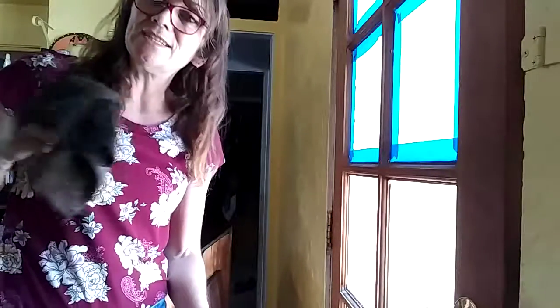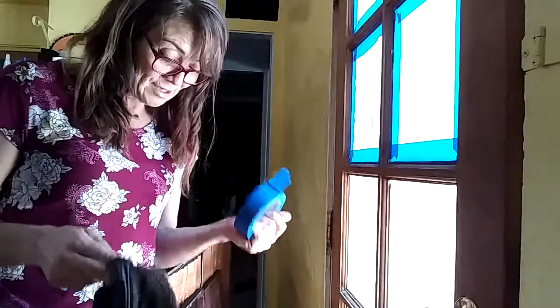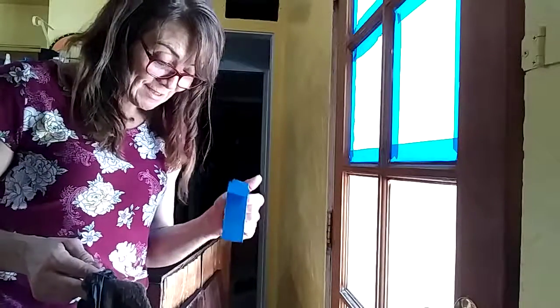I like to use a rag, and I also use gloves. It's a nice terry cloth kind of kitchen rag that soaks in the oil really easily, and I prefer that to a brush, although a brush is an option. Again, it's Minwax wood finish.